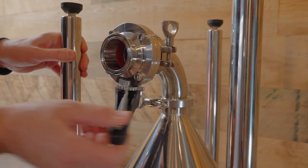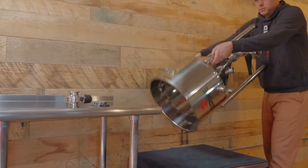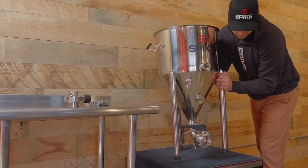Let's talk about the dump port. As you can see here, we have a big oversized two-inch dump port. Why did we design around that, when some commercial vessels out there have smaller one-and-a-half inch ports? The other nice thing about that is you can put a nice two-inch sight glass on it. When it comes time to dump your yeast, which you want to harvest a lot of times, you can do that with the sight glass, or you can put a two-inch quick-connect valve with a hose and put that into a container. It just makes for a very smooth experience.